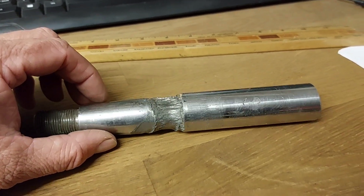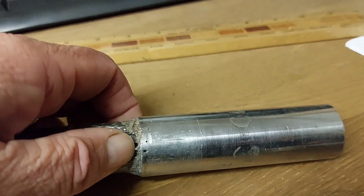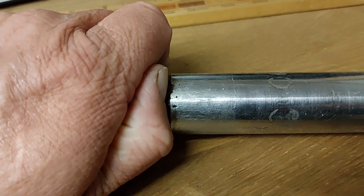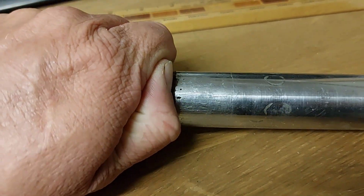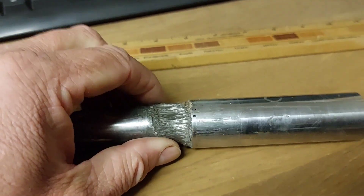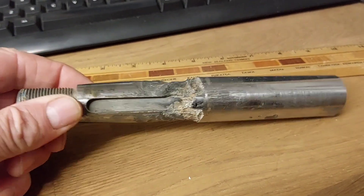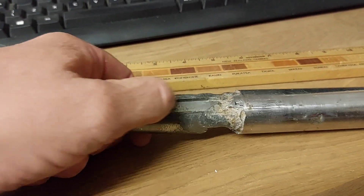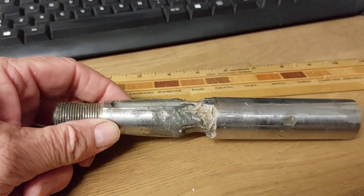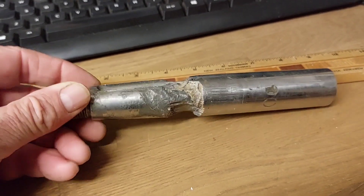This is probably one of the best examples of crevice corrosion I've ever seen. The clue for me was at the shoulder where the propeller shaft boss sat — these tiny little pinholes, that's all I could see at the start. The propeller was slightly loose on the taper and the boatyard was just going to tighten it up, but I said I think we ought to take it off just to make sure the keyway hadn't been damaged.